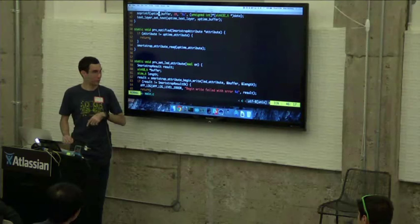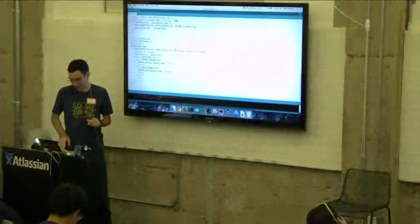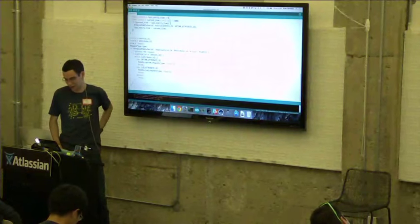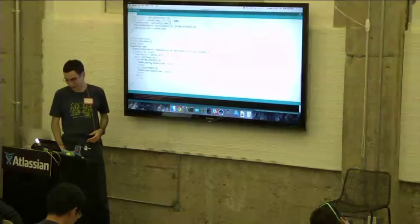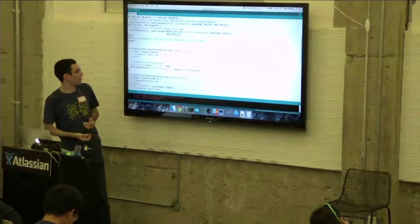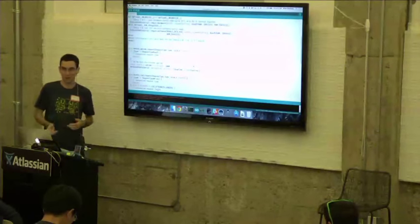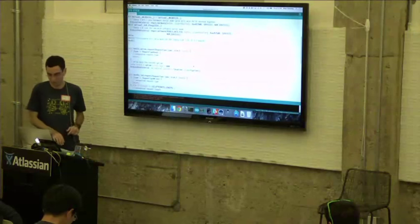So we perform this read request. Now let's go back to the Smartstrap code and see where it handles it. Again, it's within this feed if statement. In this case, we're going to call handle uptime request, because that's the read request that we're going to get. That's the attribute that's going to be requested. Here, again, I'm just verifying that the type is what we expect, which is a read. And then I'm writing the uptime in seconds back to the watch.